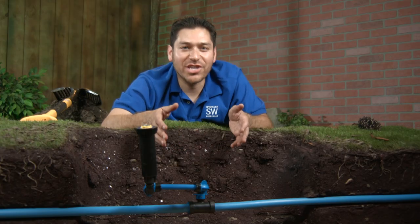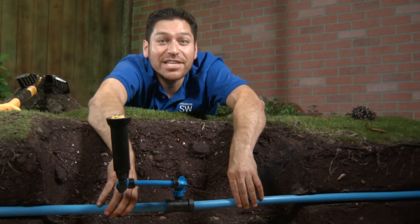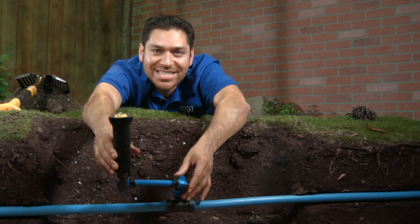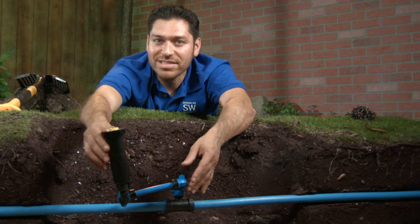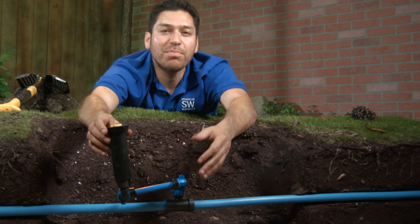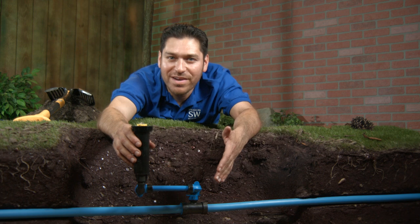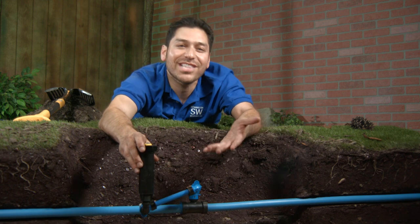Now let's check this Blue Lock setup. This pipe right here is more flexible, less likely to break from the weight of something like a car on it. Not only that, this elbow swing assembly offsets from the pipe. So weight applied to the top of the sprinkler head no longer puts downward pressure on the pipe. If there is a lot of pressure on the sprinkler head, it will swing down, making a broken sprinkler head much less likely.